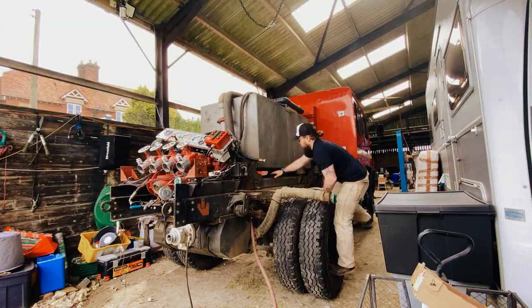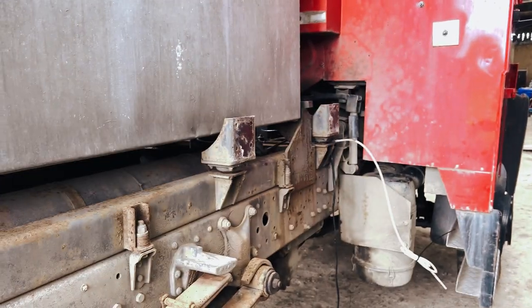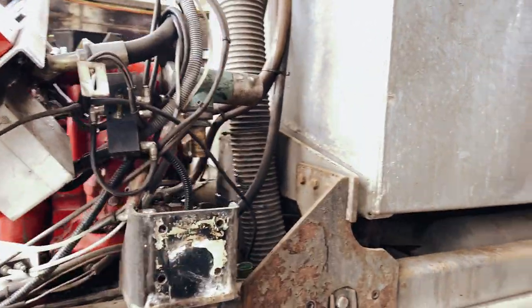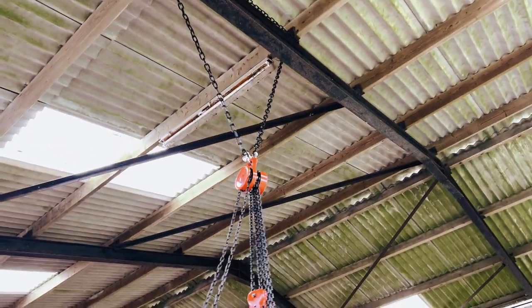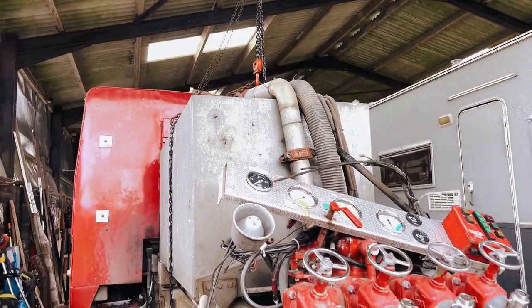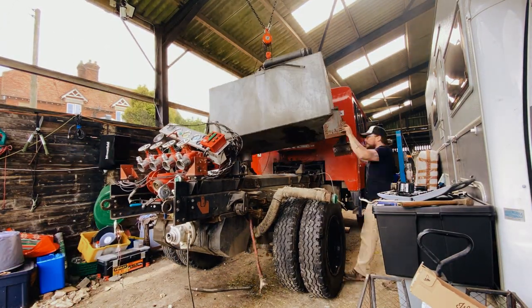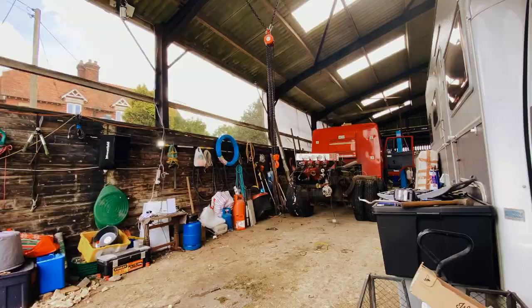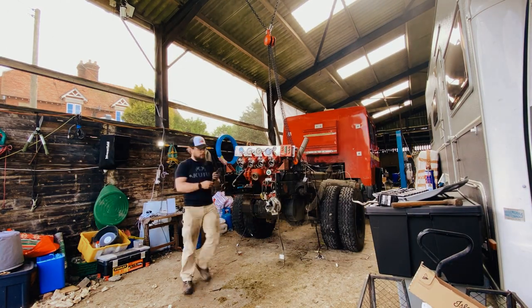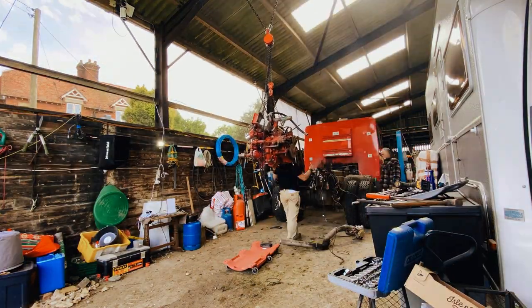Once I had the main bits of the back end off, I pulled it into the barn where I could start attacking the water tank and the water pump. I removed the bolts on the bracket, disconnected all the pipes on both sides, so in theory it should just lift straight up. I've got a block and tackle on the roof with the tank chained up, so we're about to lift. These were pretty straightforward and easy compared to the rest of the back end — literally just a case of undoing things, undoing wires and anything else connecting them to the vehicle. The water pump was straightforward too — just four fairly substantial bolts holding it down, and once I had the PTO off and other cables, it was pretty straightforward to lift up.